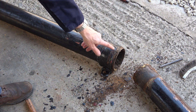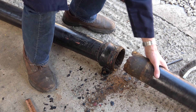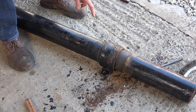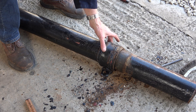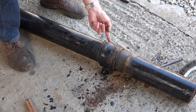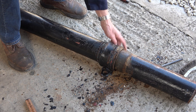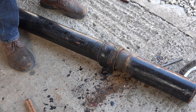This is the pipe socket I was talking about — that came out of there. What I plan to do is cut this off here. This area should have enough material that I could thread it internally. I'll clean it up, I'll cut these ears off just to make it a bit nicer, and it should end up like a big nut that threads onto the end of the pipe.